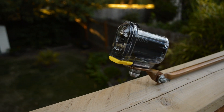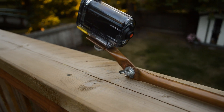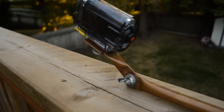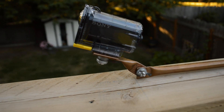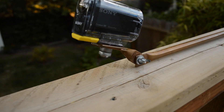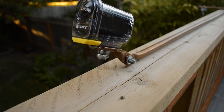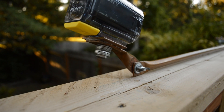At the front end here we've got a solid copper camera mount, and it's held together with bolts and solder so it's super incredibly rigid. It's really important to have a rigid camera mount on a unit like this one, because if your camera mount wobbles your footage is going to be shaky — it's as simple as that. I had to play around with the design of this camera mount for a while before I got it right, but as long as you're careful when you're building it, you should be able to replicate what I've done here fairly easily.